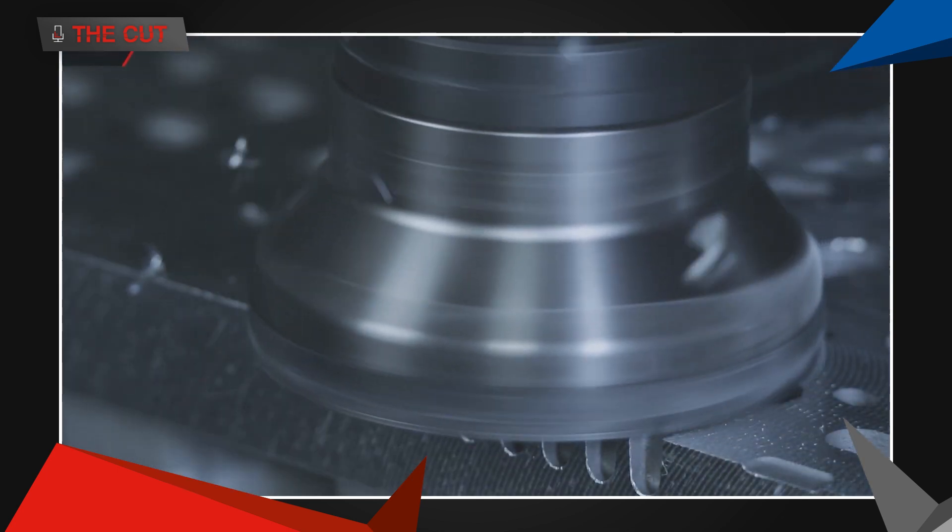Salvatore, tell me a little bit about this particular product and what it is capable of. So the MaxiMill SEC12, the so-called suction effect cutter, is an amazing rough face milling cutter with PCD inserts. The MaxiMill SEC12 has an 8 mm cutting depth, and here you can see this milling cutter in real life. The main benefit of this SEC12 is the perfect chip control achieved by the suction effect, for nearly chip-free components after machining. But the video says more than a thousand words, so let's have a look at the MaxiMill SEC12 product video.